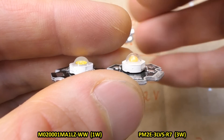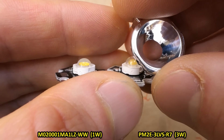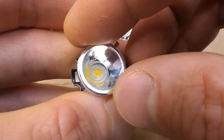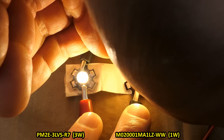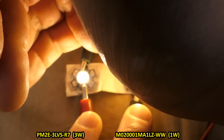The phosphors in the LEDs look a bit different. In one of them, the phosphor actually protrudes a bit more into the front. This changes the behavior of the reflector — with that one it's actually a wider beam, with the other it's a much narrower beam. The phosphor is probably closer to the focal point of the parabola, which focuses the light more.